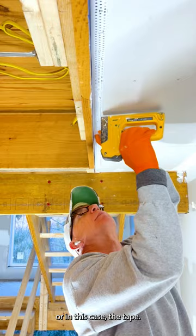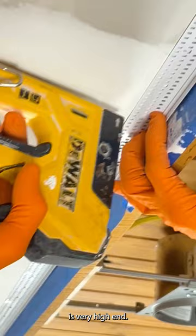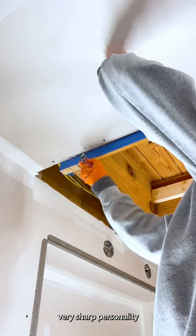You may be asking why I'm stapling this and not gluing it like I have done in one of my previous videos on drywall return windows. The reason is because this job is very high-end — it's up against rough cedar, and if I get glue on it, it would be very difficult to get off.